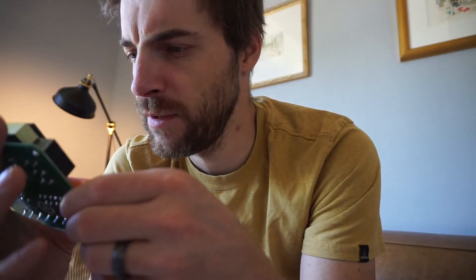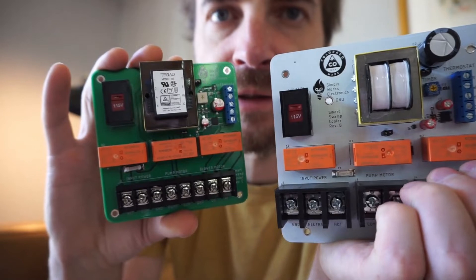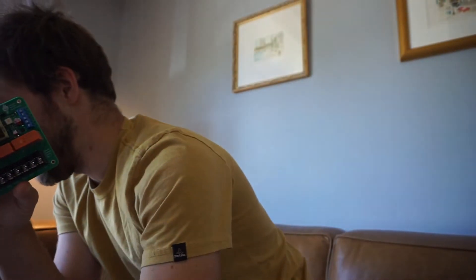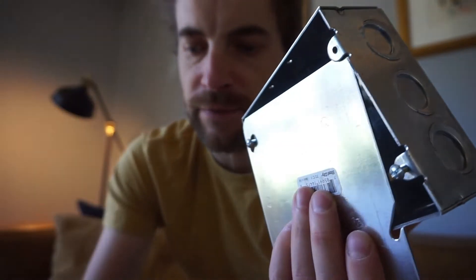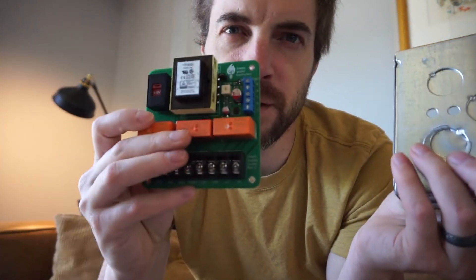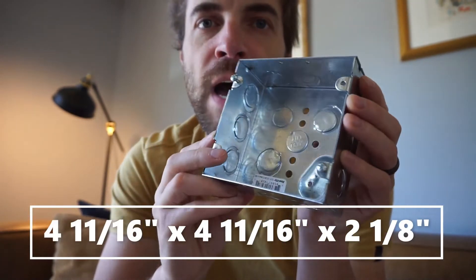For the most part, it's pretty much the same thing, just in a smaller form factor. The idea is you could put this thing in the wall — remove one of those mechanical swamp cooler switches, and just install something like this inside your wall. The board is about 3.9 by 3.9 inches, so it's not quite four by four, but it fits in a four and eleven-sixteenth inch box like this easily.